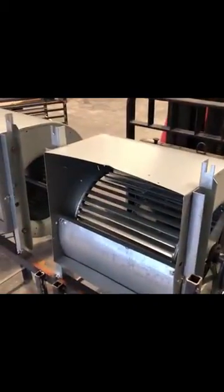That's when I began my investigation to see if this was wired for 208/230 or 460 volts. It was wired in a combination of both. I'm not an AC motor expert and I don't know exactly how they even got it to work halfway, but the result is they threw away the entire heat exchanger. This unit was never used — not even a lick of paint has come off. Anyway, I got a new motor and an air cooler out of it. Have a good day.